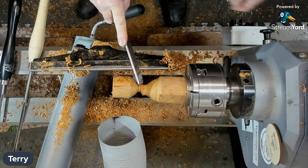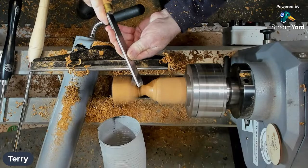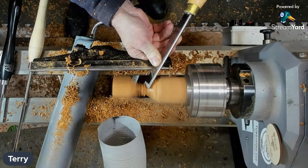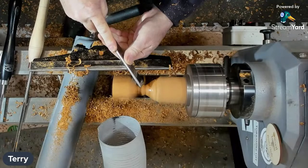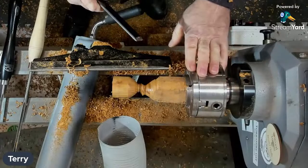Actually, while I was in France, one thing I learned were a couple more tricks for taking old gouges and turning them into new tools. For example, if you have a spindle gouge where you basically have almost no flute left, if you take a little abrasive cutter on a Dremel and you cut little score lines in the top edge, you can then use it to make texturing marks such as Nick Agar does.